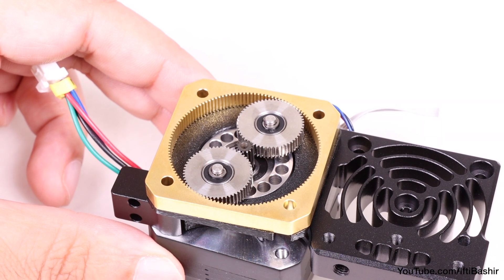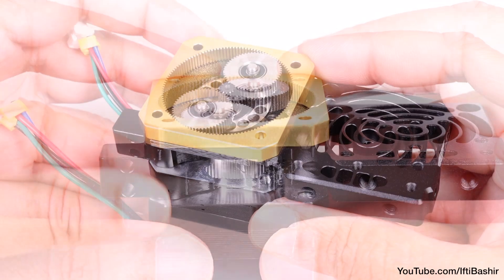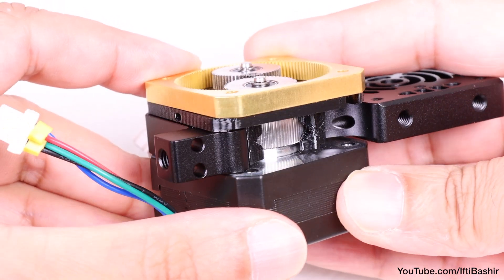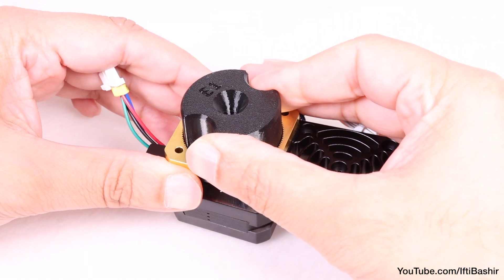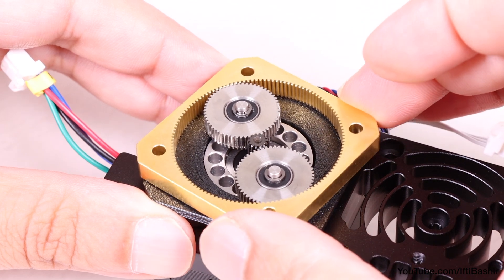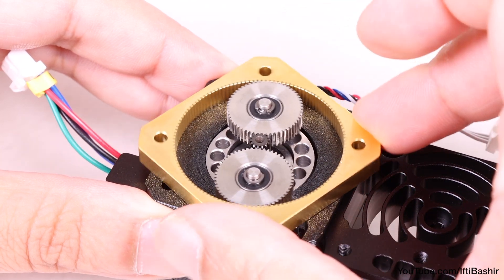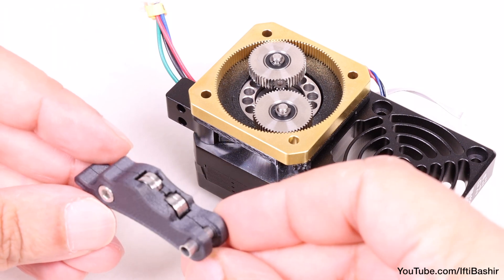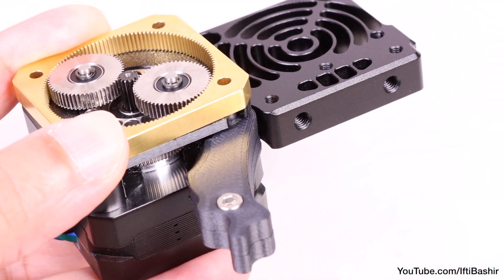Inspect the assembly: the ring gear and gear assembly should be completely flush, and there must be no gap between the ring and the main plate. If you see a gap, remove and reposition. You can rotate using the gear tool to ensure everything is smooth. If tolerances are too tight, carefully turn the ring gear alone to ensure the cogs are meshed to the central motor pinion and freely rotate. Once happy, insert the idler assembly between the ring gear and extruder motor, aligning the idler spacer with the hole in the ring gear.